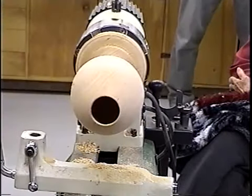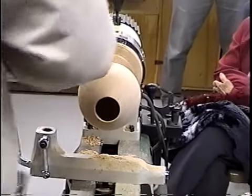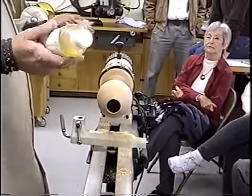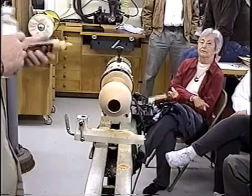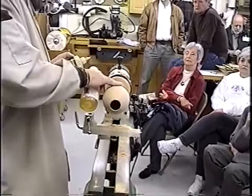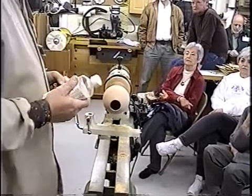And then there's the Turner finish, I use that. I use the crystal coat, whatever the mood strikes me. I think I like this one probably a little better. This one has solids in it that fill the grain, so it will fill it, make it a little smoother.